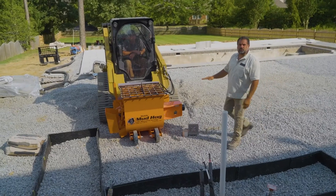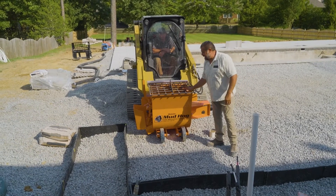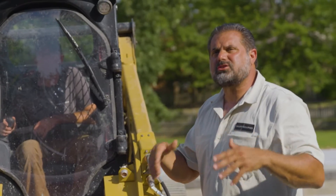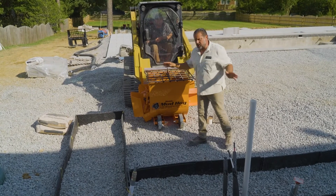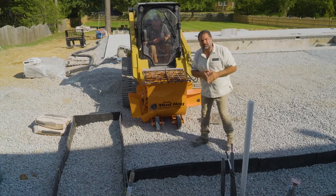Four parts three-quarter-inch clean aggregate, one part Portland cement — this is going to be the dry base for our kitchen island. It's going to increase our frost and freeze-thaw resistance, and will also dissipate water very quickly. This kitchen area will be washed frequently, and we don't want any efflorescence or mineral deposits to build up around our block.